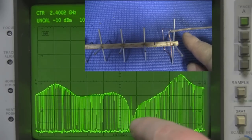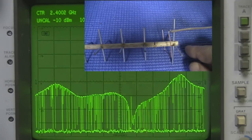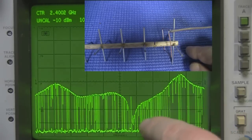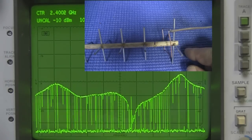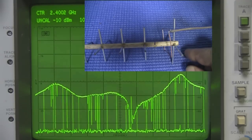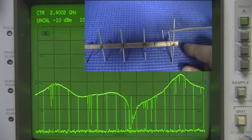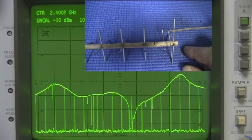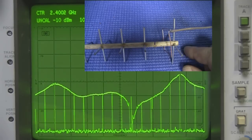Having the main driven element closer to the reflector makes this a slightly better antenna with a slightly better VSWR. I'll have to measure this on the network analyzer, but just going by the pattern and the frequency response, I can tell you that is an excellent VSWR. I wouldn't have found that without experimenting with the position of the main driven element — and especially how it can affect the center frequency of the antenna, which I didn't think it would do, but as I've just shown here, it does.